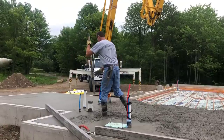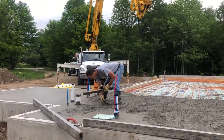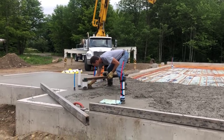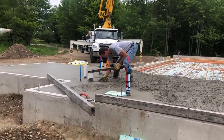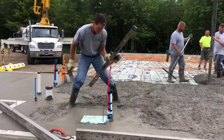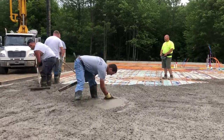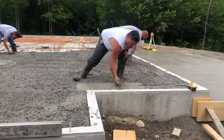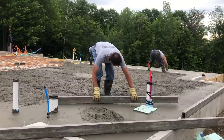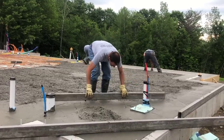This has got three loads — three different trucks. We usually like to pump out a truck and get rid of it, and then let the second truck back in while we screed and level out the first truck. Right now we're just going through the area of the floor that has the most pipes — it's a pretty wide open floor for a house, not much plumbing, just in two different sections.